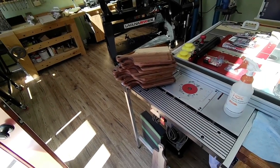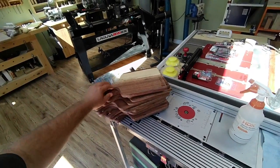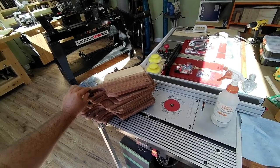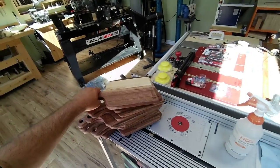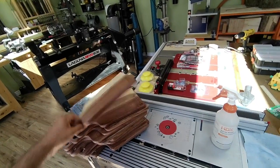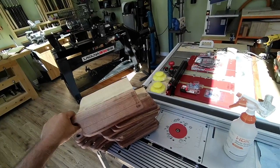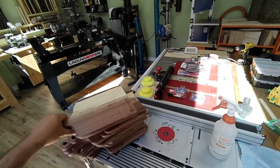Welcome back to the shop. I was making some of these boards and I left them all sitting like this before engraving them, and a bunch of them had the tiniest little warp on them. I don't want to send that to my client like that, so I know how to fix those. If it has a slight warp, you spray water on the side that has the warp and leave them in the sun. Or you can use a hot iron and do it quick, but if it's a sunny day you can just leave them outside with something flat on top and within an hour or so they will straighten out.